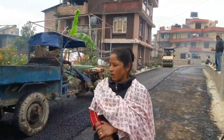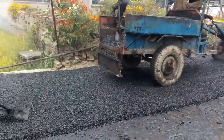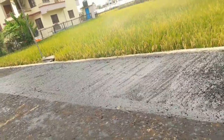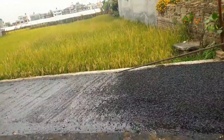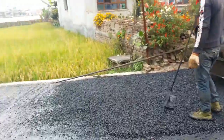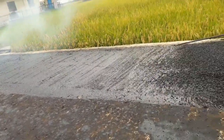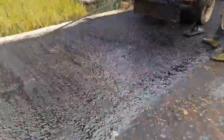We transported the material using a small tractor and it needs to be laid uniformly all over the site. You can see this guy is laying tack coat over the prime coat, because tack coat prevents slippage and functions as a long-term sealer to protect the substrate from moisture and bacteria. Just before application of the bituminous premixed carpet, the tack coat needs to be laid uniformly.